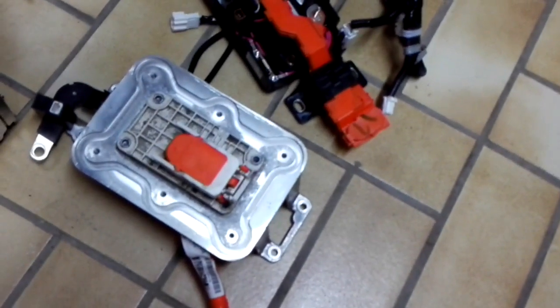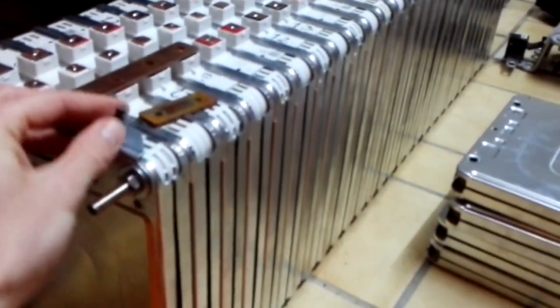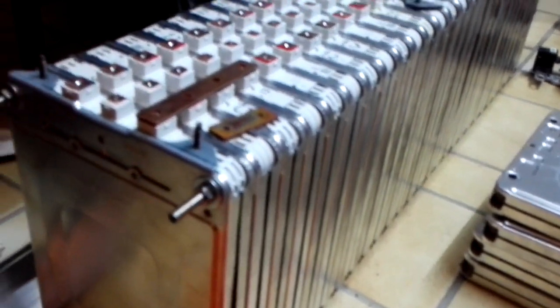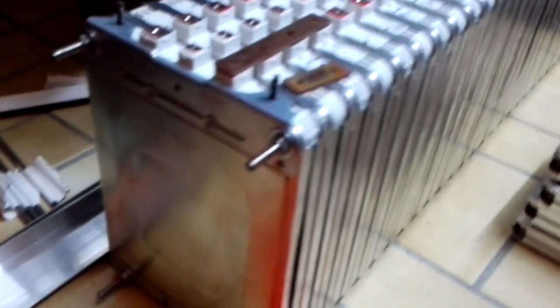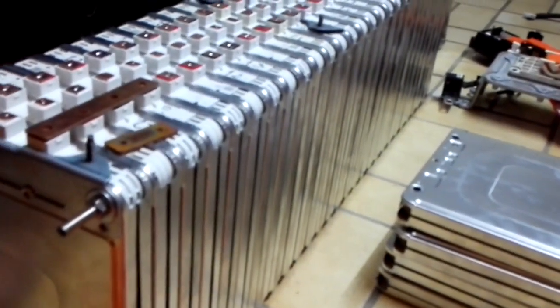We should have plenty of space there. We get this service interrupter right here that I intend to use as well, and the switches. A number of cells have these rods sticking out, and the cells with rods also look a bit different on the back. You can put an M6 screw in this hole, which will enable us to use some screws and angles in the back to screw the batteries tightly in place. Apart from that, there are four M8 rods interconnecting all cells mechanically, so that should be pretty rugged.